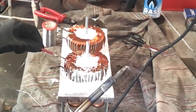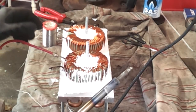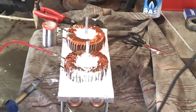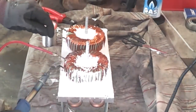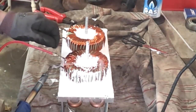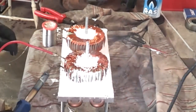Taking the iron away. Because there is so much thermal mass here, we actually have to hold a bit of firm pressure on each joint, just until things cool down a bit. And that's that one done. Moving on to the number two joint for this inductor — bringing the nice hot iron in, starting to warm things up, getting a nice flow of solder going, making sure we work it in as much as possible into the cores.